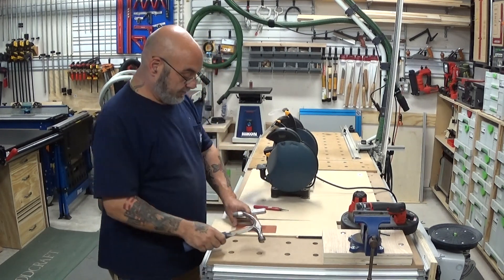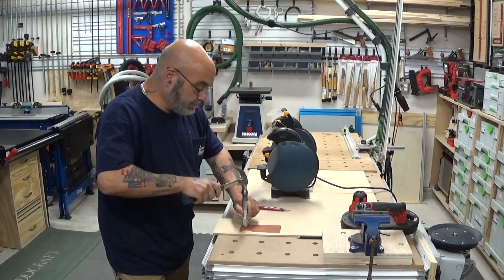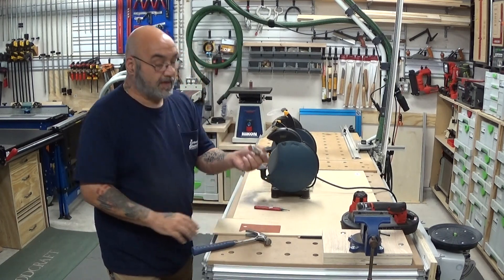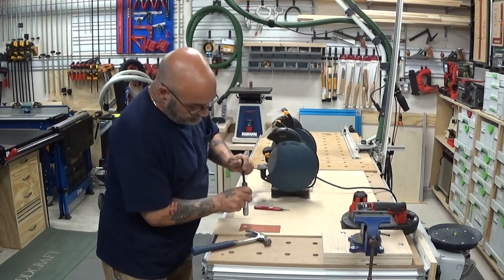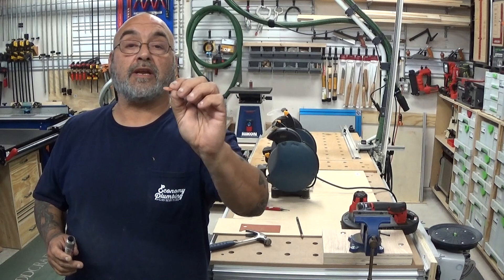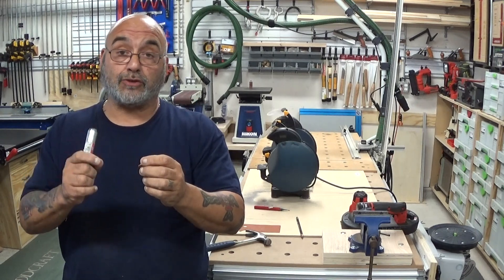Now let's try and see if it's sharp enough. There you go — take something to pop it out, and now you have a nice little round circle that you can use as a foot. You can glue it, CA glue it, hot glue it on. The bigger ones, a little bit thicker, you can actually drill a hole through it and use a screw and a washer.